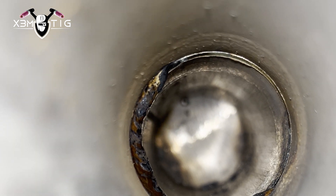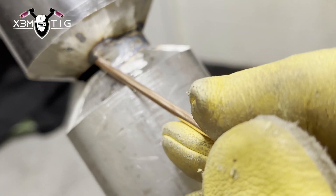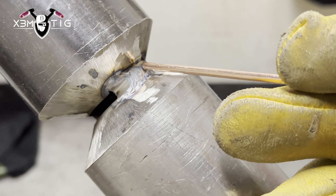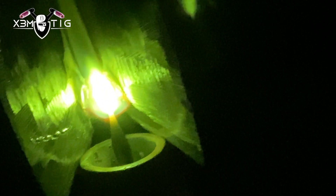Now I'm going to do the same thing on the other side. I remove that tack and go all the way up, removing the top tack as well. I did make a mistake — I forgot to remove it the first time going up. When you go on the side, remove both tacks at 12 o'clock. It's not going to shrink; it's a small pipe so you go fast — it takes maybe two minutes to do one side with grinding. Dipping technique allows you to have better control over your puddle and heat input for nice uniform welds.